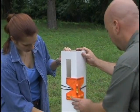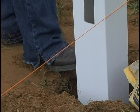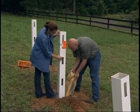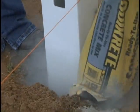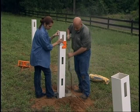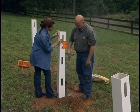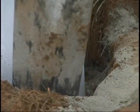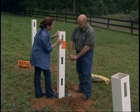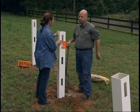Hold it here, watch your levels — watch that one and this one. Now put the toe of your boot against the bottom of the post, just so when the concrete goes in it doesn't move our post all over the place. Just lock your arms and lock your toes. Now just dump in the dry concrete. We'll take this sharpshooter spade shovel and tamp it down to get the air bubbles out of the concrete — just go back and forth around each side lightly. What about the water? Ancient fence builder's secret — we're going to talk about water a long ways from now, but right now we just need to put dry concrete in the hole, then we'll come back and talk about water. Still level? Great. Let's go do the next one.